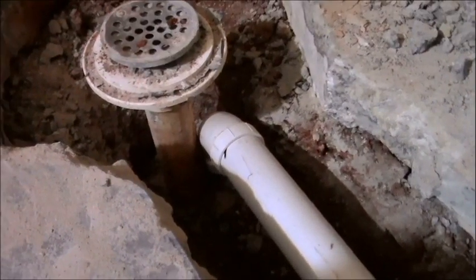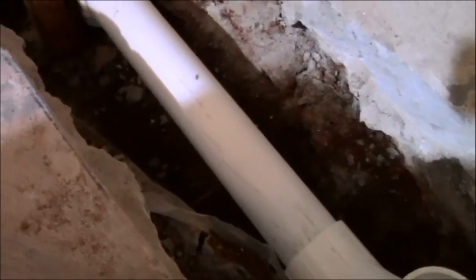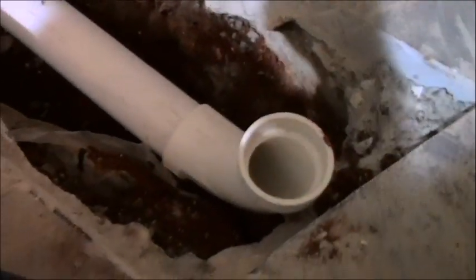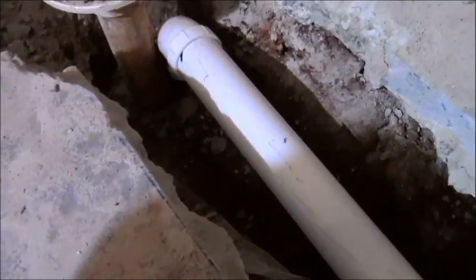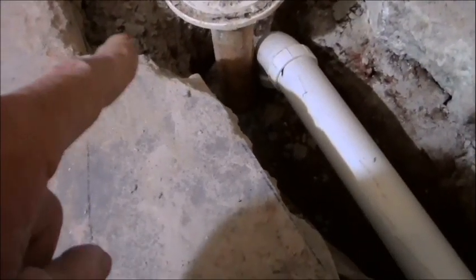I have the rise that I need. That 1/4 inch per foot we talked about on shower pans and stuff like that has more to do with drain lines than anything. It's a plumbing thing for water to flow with gravity. That's important. If there's no gravity, wicking takes over. But that's a whole different issue. I digress.